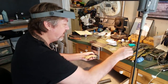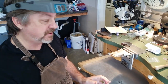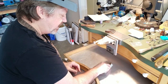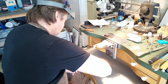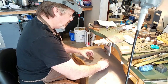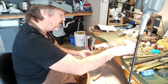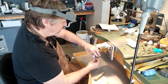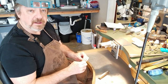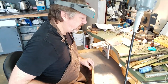The first thing I want to talk about is metal preservation. When I start cleaning up at the bench, I clean up my lap pan — a lot of people leave a lot of stuff in there. I think you should clean up your lap pan, save your sweeps, and this way when I'm done working on this 18 karat ring I'll sweep it up again and we can send those off to the refiner.